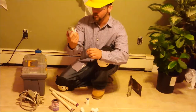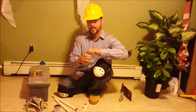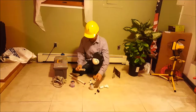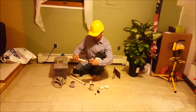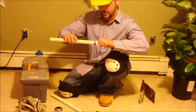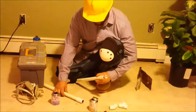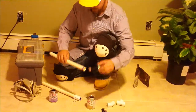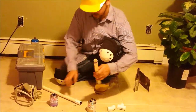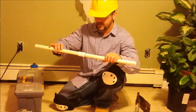Second thing you're going to do is take your PVC glue. Now this is permanent — once you put this together you cannot get this apart. It will not come apart, ever. It's waterproof and all that good stuff. So what we do is put the glue right around the first piece, stick it in, quarter turn — that's it. Second one: just right around, very very simple. Put the cement away. Together, quarter turn, and that's it.